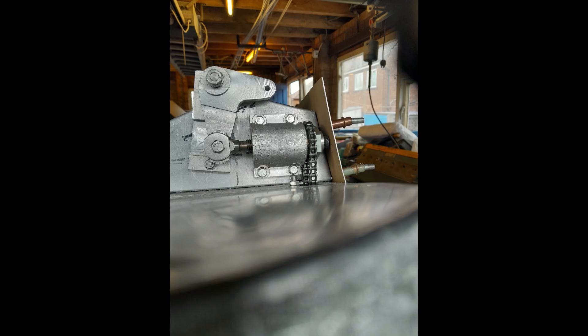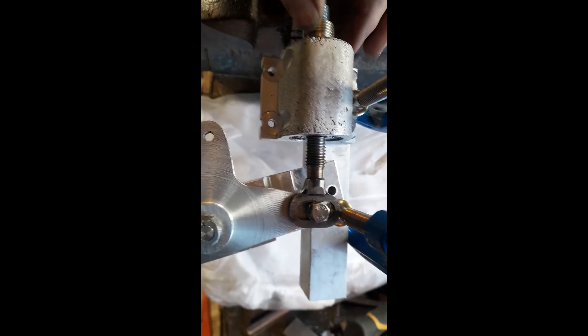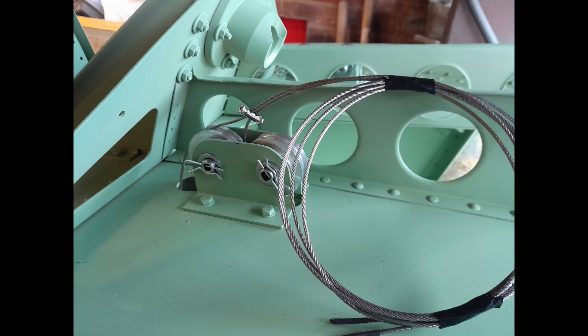The bush, when revolved, moved a threaded trunnion shaft. The trunnion housed a sliding pivot attached to a small bell crank to which the trim tab push rod was connected. The operating cables of both rudder and elevator trimming mechanisms are supported in grooved double roller blocks.